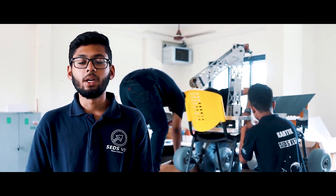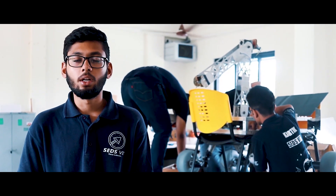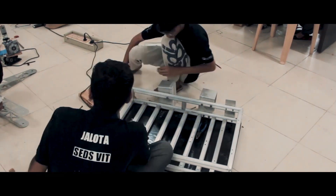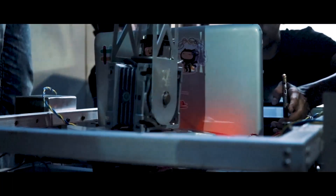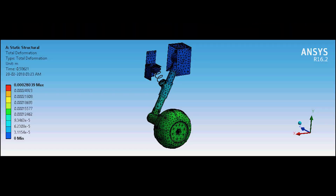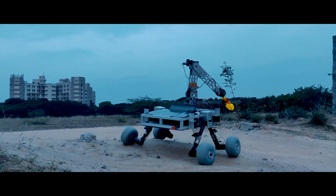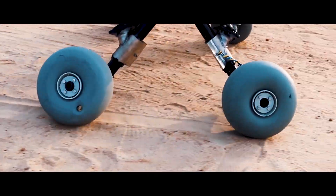The primary focus was to make the rover structure as compact as possible and ensure smooth traversal on difficult terrain. The chassis is designed with square aluminum weldments for better stability, divided into components that provide better airflow and avoid heating of electrical components. Containers are mounted for soil sample collection, governed by an auger and robotic arm. The rover works on a four-wheel suspension drive with a modified McPherson strut suspension system, providing independent damping capabilities and smooth traversal on any rough terrain.